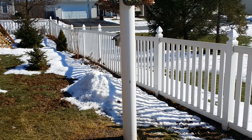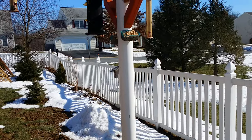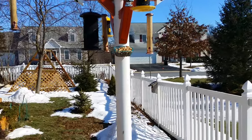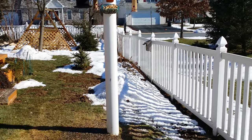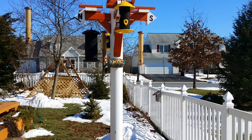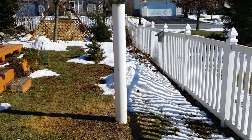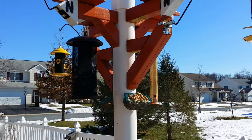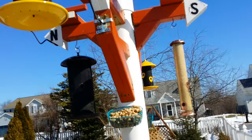I thought about it for a while and came up with using PVC pipe. I got a 10-inch PVC pipe from Home Depot, brought it home, and cut it to size — about eight feet. To keep it erect, I have a treated four-by-four inside the PVC pipe. I dug a hole two feet deep, put the PVC pipe over the four-by-four, and used one bag of Quikrete at the base. I added a design at the top marking north, south, east, and west — actual directions here in south central Pennsylvania.